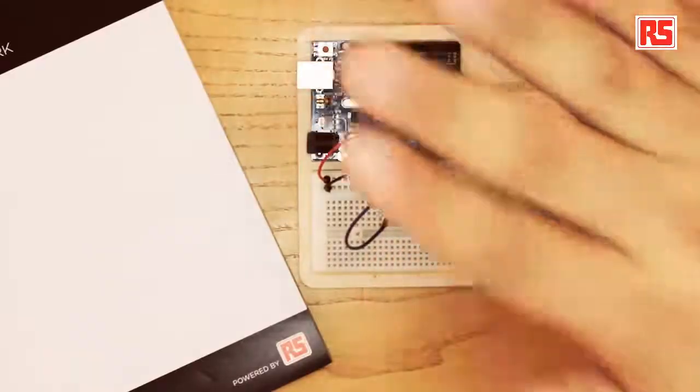In this particular case, we're going to be building a very simple theremin using a light sensor as a way to capture the position of the hand of the player from the Arduino. You'll be using a photoresistor to detect the amount of light, and from the amount of light, we are going to guess the distance of the player's hand from the sensor.